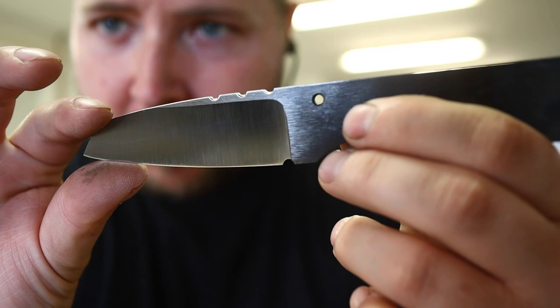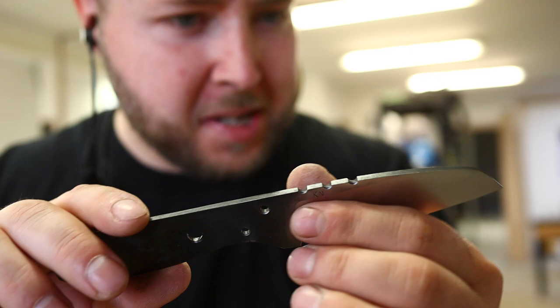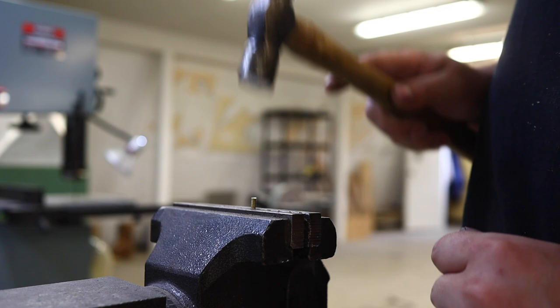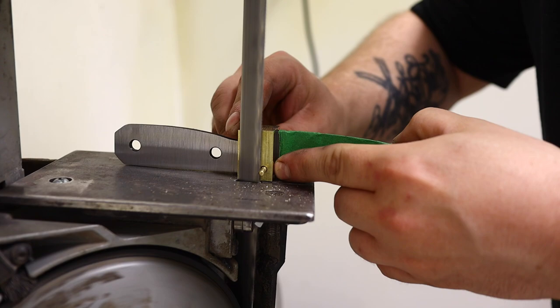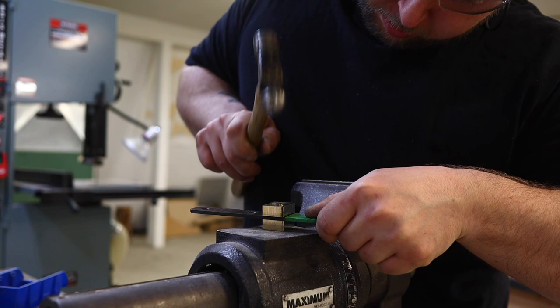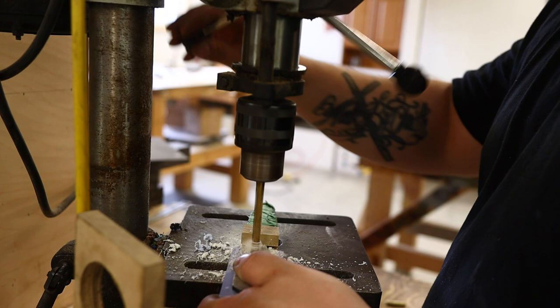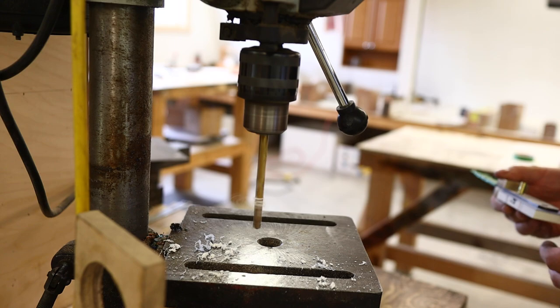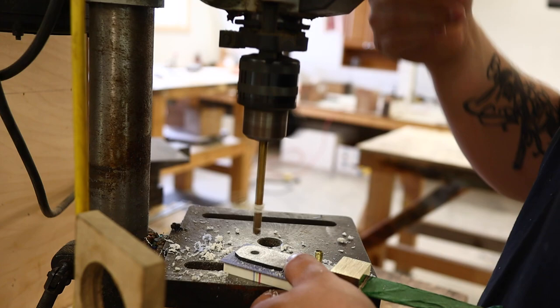I like that — look at that blade finish. A little bit smudgy there now, but we're going to get it covered in tape. We have a very fine edge that's ready for sharpening. This is just going to perform beautifully. Now it's time to get the brass on there. We peen out one side of the pins, put them through, cut off the excess length to just right in the sweet spot, and then peen the other side of the head. It's a permanent fit at that point.